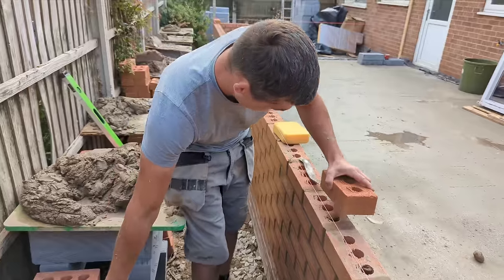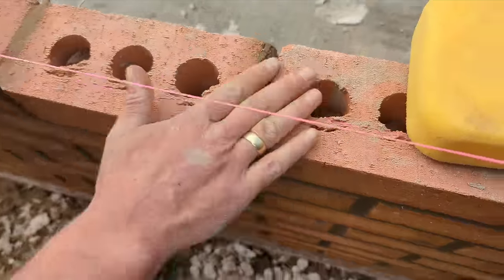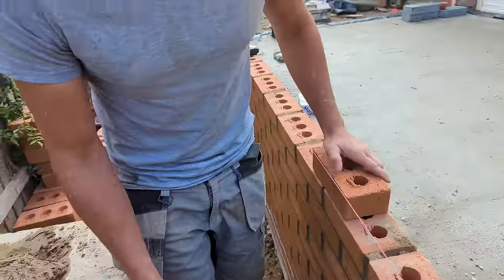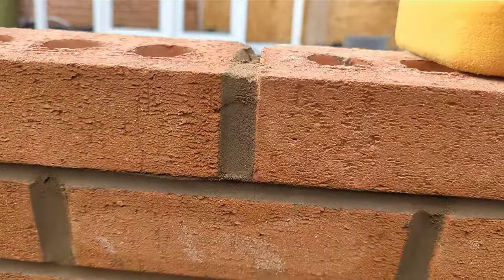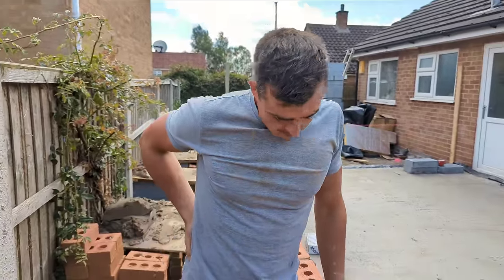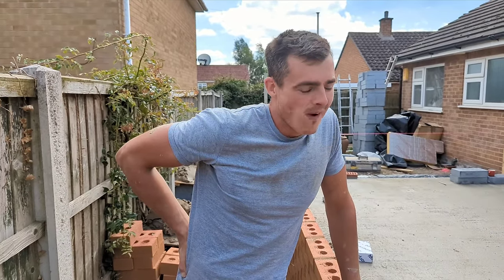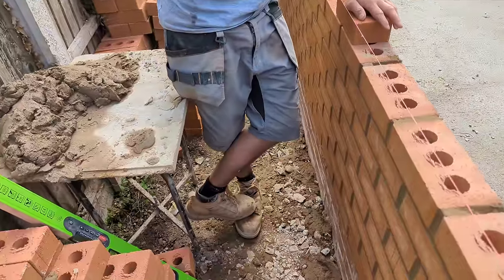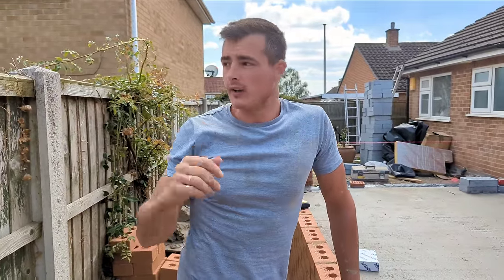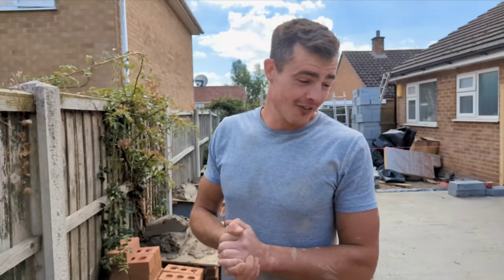So they're not much smaller than the engineering bricks. The issue I'm having - can you see how they're slightly chamfered? They've got two chamfers, so even if I was to have them dead tight together I will still end up with a five mil perp just because of that chamfer. Joints down here were already slightly big - talking 12 to 13 mil. I thought that's perfect, I'll be able to get over that because I'm going to have bigger bricks. However these bricks have turned up with their chamfers and it's meant to be really big joints. They're about 13 mil, but they look big. I've done my best to keep plumb perps. People might call me out saying I should have set my footings out differently, but at the time I didn't have these bricks. It just didn't work. Slight problem, but solutions not problems - it's just one of them. Luckily it's facing the neighbours, and my parents aren't even going to live in this house for more than two years. Every cloud. Let's get blasted.